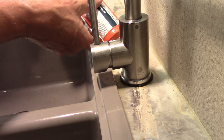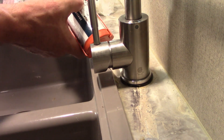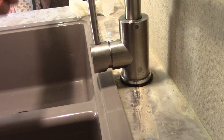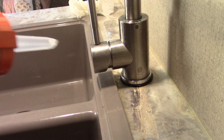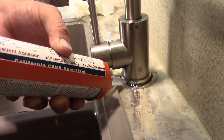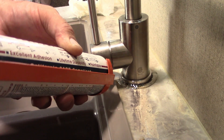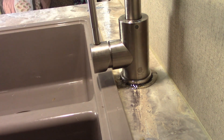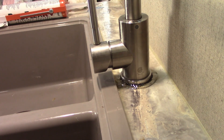So as you start to put this down, just put a little bead around. When you come to a point where you have to stop, go ahead and release the plunger on the caulking gun — that will help keep it from continually squirting out on you. Then come back in, just slowly squeeze, then come back around. Once you get to a spot where you can't get any more, release the trigger, release the plunger, and that way it doesn't continue to squirt out on you. Saves getting a mess all over the place and actually saves on wastage of the caulking product.